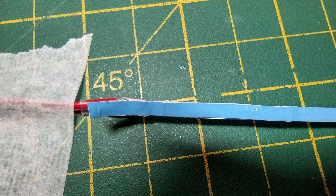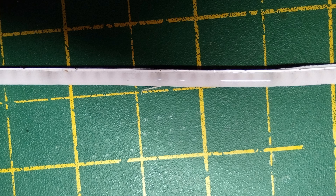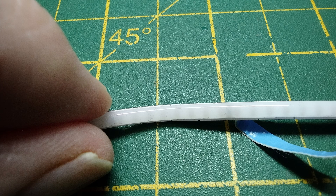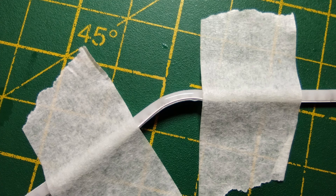This is a close-up on the LED lights — they've got a sticky bit on the bottom and if you peel that off you can see cut points where you can cut these LEDs. If you look at that tiny little dot, that's where each cut point is. There are the dots in the middle, and if I flip it over, those correspond to the cut points underneath. This LED tape does not like being bent horizontally — it kinks up. So where I have angles, I'm going to have to make a cut and do a little bit of wiring.